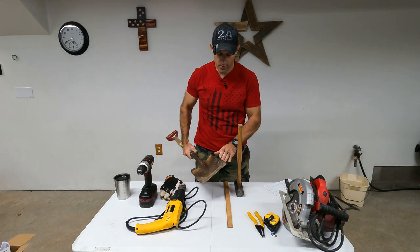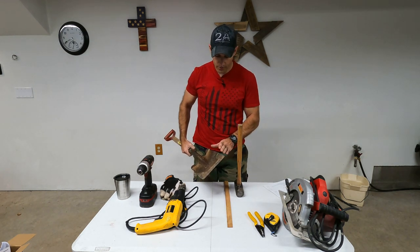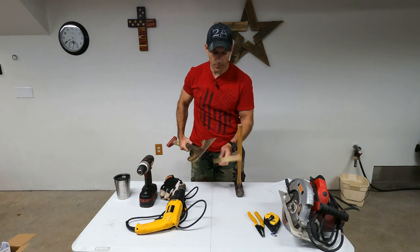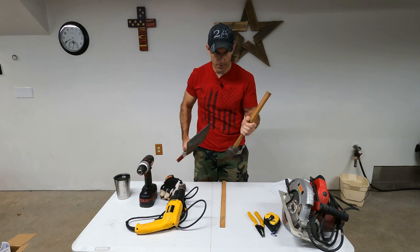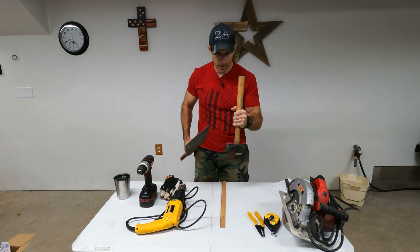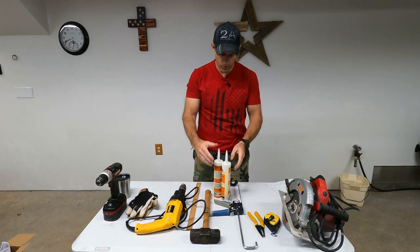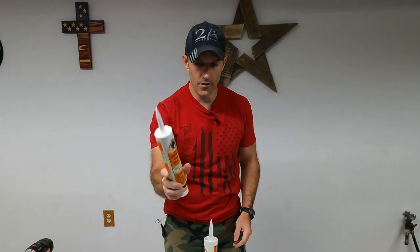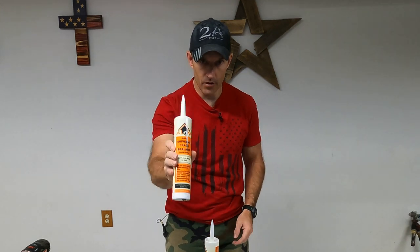You may need a circular saw with a blade to cut through an asphalt or concrete driveway. I'm going to use a string line to snap a line across my driveway for a nice straight cut. You'll need wire strippers, and if you don't rent the machine I rented, you'll need an edging shovel. I did my first house with an edging shovel — it's cheaper but a lot more work. You'll also want a stick to help push the wire down, and I used a sledgehammer to pound the crack closed to keep the wire in the ground.